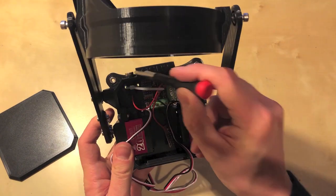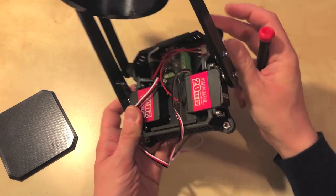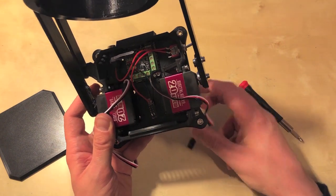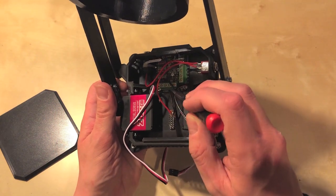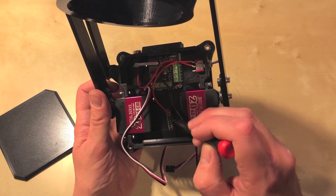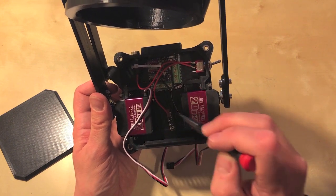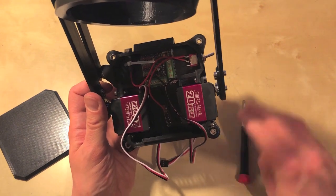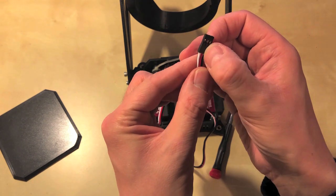Now I'm going to install this into the OSR2. The female barrel jack goes where the original power connector was, and this connects over to the new switch so you can switch the servos on and off. In the middle we have the pin rails. The extra ground wire here is important: because we're still plugging the servos into the Romeo's signal pins, we need to connect this ground lead to the Romeo to complete the circuit — otherwise nothing will work. Power comes in from the barrel jack and goes directly to the pin rail without needing to go through the Romeo's tracks.